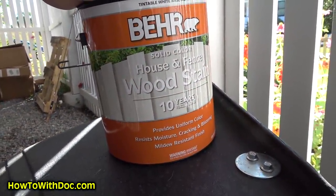If you have bare wood, I would strongly recommend going with a solid stain because you can always paint over a solid stain — it almost acts like its own primer. If you're going to do a white picket fence or a house that's solid wood, it's not a bad idea to start with a solid color stain. It will fade over time, whereas paint will crack and chip. Stain bonds much better to the wood. You can apply solid stain on a fence, deck, or house, and later come back and apply another coat of stain or switch over to paint. That's why on this picket fence we're going with a solid stain — it's going to seal it, absorb better, last longer, and not chip off.